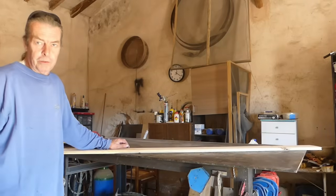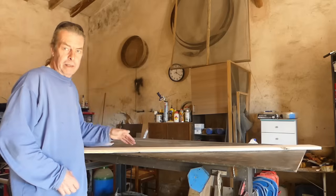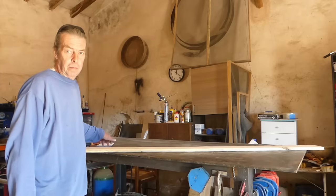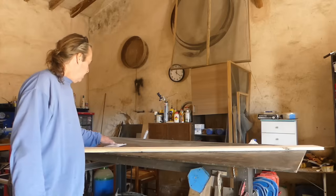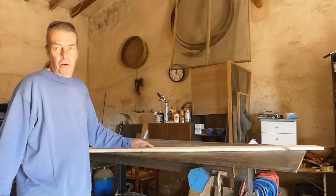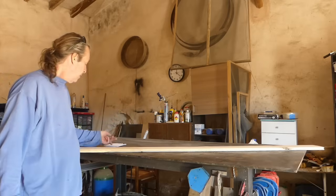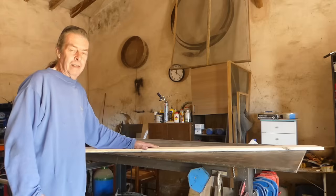Right, so I'm on to plan B already. I've just remeasured them. I'm going to make them slightly smaller. I wanted to give myself a bit of excess to make it easier to cut the arch out of them, but that would waste an absolute ton of wood. So I've brought them both down by 50 millimeters, about 2 inches. That still gives me enough left to cut my arch out of, which means I'll get 2 for one door and 1 for the other door out of each piece. There's going to be a bit of wastage, obviously. I'm also going to need the strips for the width, 650, which is the width of each door, so I'm going to incorporate those into my measurement. So just get cutting.